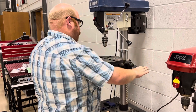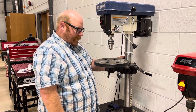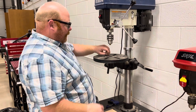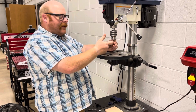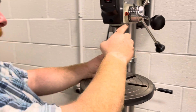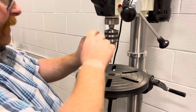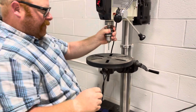I'm going to bring this up a little bit since we don't have a very big piece for the demo today. Now it's time to put our bit in. The most important thing is to make sure your drill bit is straight in the center of the teeth that are going to tighten down on it. Righty tighty, lefty loosey — hand tighten it as far as you can go, then take the chuck key and insert it into one of the chuck holes and make sure it's tight so it can't go anywhere.